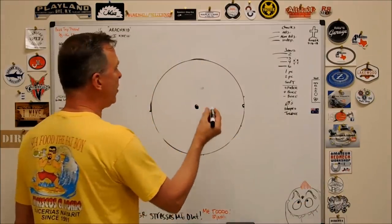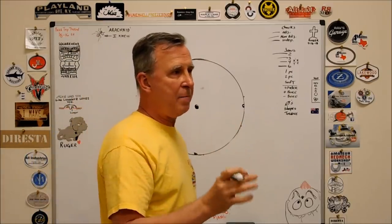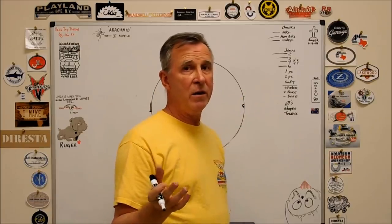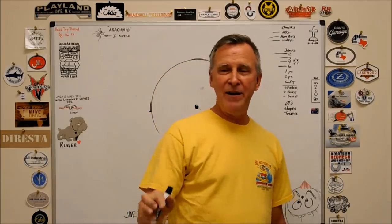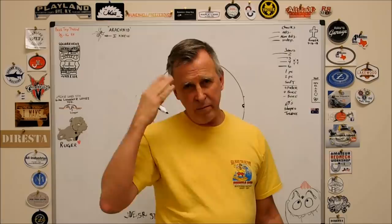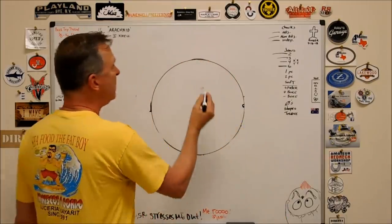When you do your jaw, do not bore those jaws until the part slips in. What have you done? Well, what you've done is you've put a larger radius in your soft jaw than the size of your part. So what, you might say? Well, I'll show you so what.